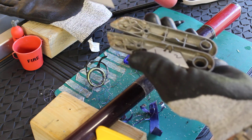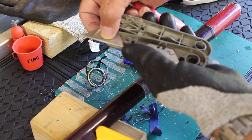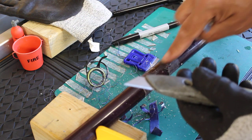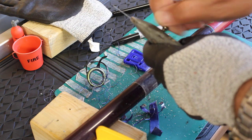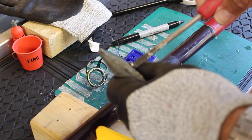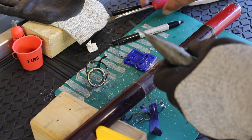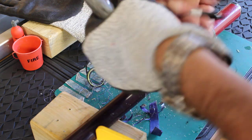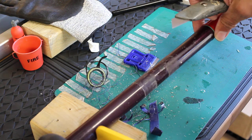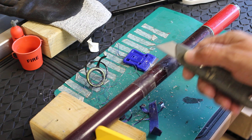I think you can just see some ridges in that blade already, so it's starting to wear out. So I'm just going to swap it over, and you'll need to do that when you come to this close-up work down here, because you need a new blade. Now when you're using new blades, don't forget they come coated in oil, so give them a rub with alcohol or white spirit just to get rid of the oil and grease, because again you'll have problems if you've contaminated the rod. So just to show you, new blade has gone in, we're number two, so that's fine.